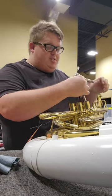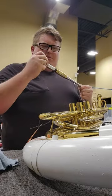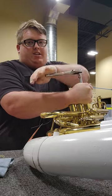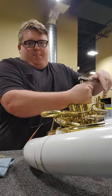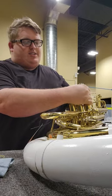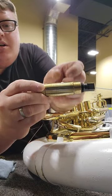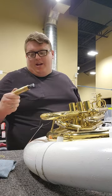That passes through pretty freely, so I know that it is too loose. We're going to tighten that down a pretty fair amount because we've got a ways to go, and just slowly work it through the valve casing. You want each rotation to overlap so you get even pressure on the whole valve casing. I'm applying gentle downward pressure as well, and that's going to pop out the bottom. We will take a look at the burnisher — we're getting contact from here to here, so that is pretty good honestly.